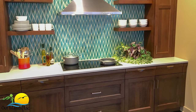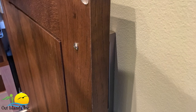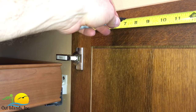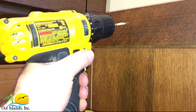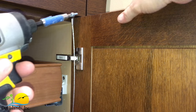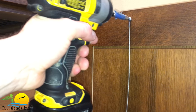Alright, let's get started with the third installation — it'll be the base door on the lower right. You can see when this cabinet door is open the handle hits the wall; we can fix that. From the back of the door measure out about seven inches and one inch down from the top of the door and make a mark with your sharpie. Using your eighth inch drill bit, drill the hole making sure to stop where the piece of tape tells you to stop. Now using the screws provided and a drill or screwdriver, mount one end of the restraint to the door.